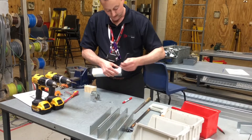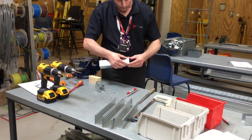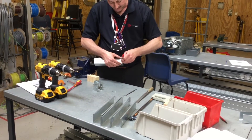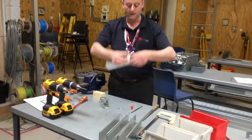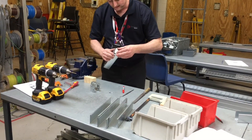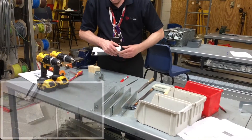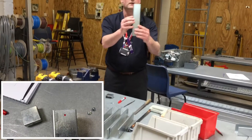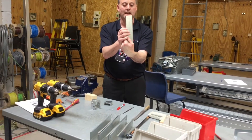We can take a scriber and make a hole — mark a circle there for the hole — or I can use a pen in order to work out my position. Now flick the process over for the other side, exactly the same. I take time to line it up into the right position in order to find my position for the drill. I've now got a marked position on both sides of the trunking ready for the bolts for the end cap.